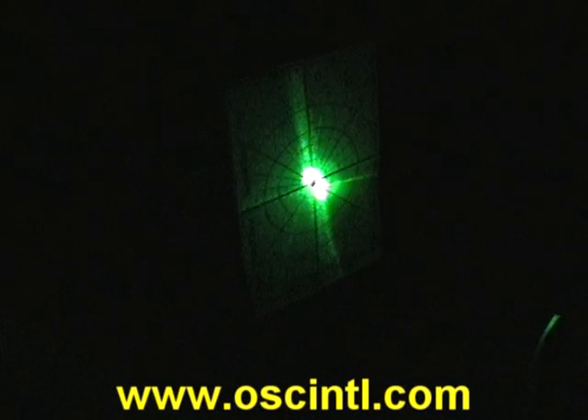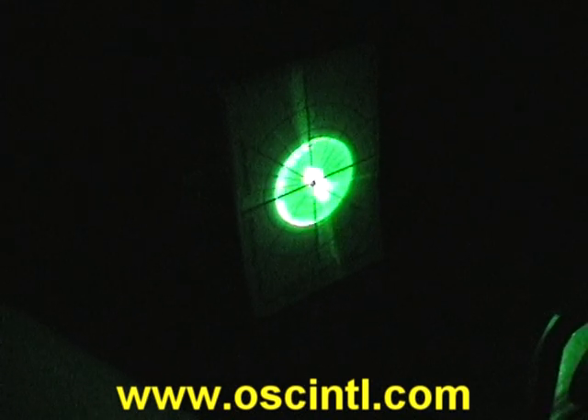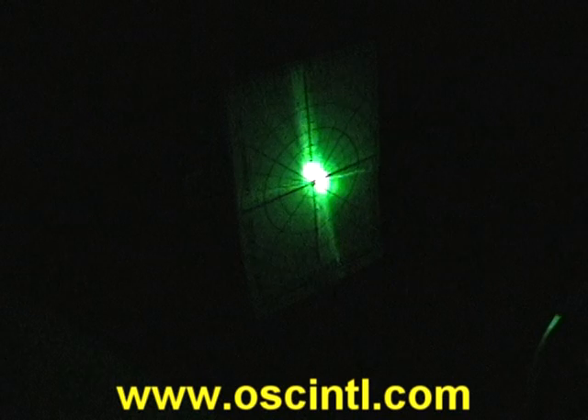I notice that my return spots move horizontally and they're displaced from each other. When I get them back to about right here, they're on top of each other. You can see that they're almost concentric with the circles on the alignment target. Now I'm adjusting the lens in elevation, watching my spots move together and making sure they're overlapped. I check the back target and find I'm still on the center where we needed to be. So now we have an aligned lens.